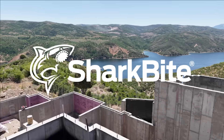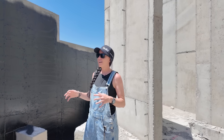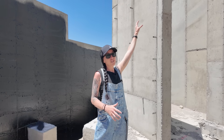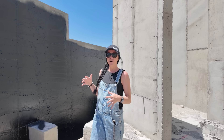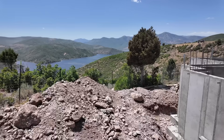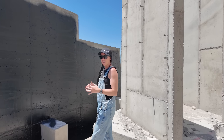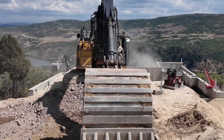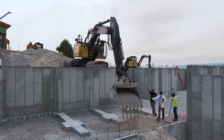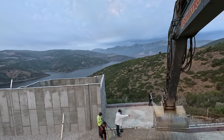Starting down here on the back of the house at the retaining walls — we have two huge foundation retaining walls supporting the majority of the back side of the house and our gigantic swimming pool structure. These two walls are stepped and tiered in their height, and we'll have exterior stone applied to the outside. Looking from the lake up at the back of the house, they'll just look like a continuation of the rest of the house. The inside of both will be filled with dirt, and they're also going to act as planters to soften the look of the back of the house.